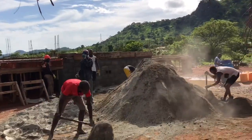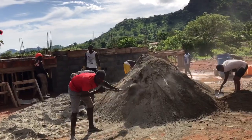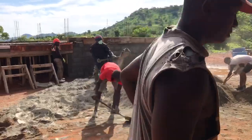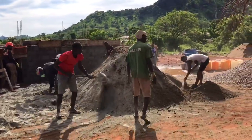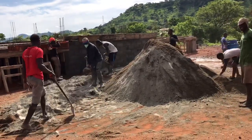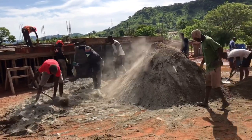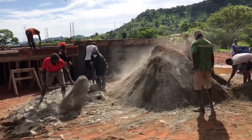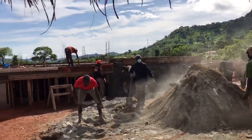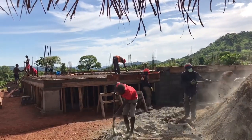So this is the concrete mixture sand. Cecil, what is the mixture on this? It's two to one — two wheelbarrows of sand to one bag of cement. That is a pretty rich mixture; most people try and get away with four to one, but we don't roll that way on this site. It's got to be done right. It's not overly thick on top in certain areas — it's going to be three and a half to four inches in some areas, and five in others.